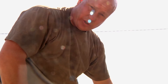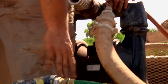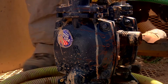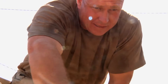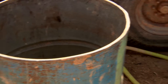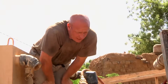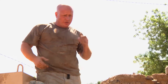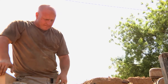Hi guys, this is the hookup when we're drilling with foam. The foam runs through a much smaller pump, very similar to a mud pump, just much smaller volume. The suction from the foam mix comes out of these tanks — you have two 55-gallon barrels. Fill them full of water, put one liter of foam solution per barrel. You don't need to mix it up too much, just pour it in, it kind of self-mixes. You'll go through about one barrel per stick and a half to two sticks if you're drilling right.